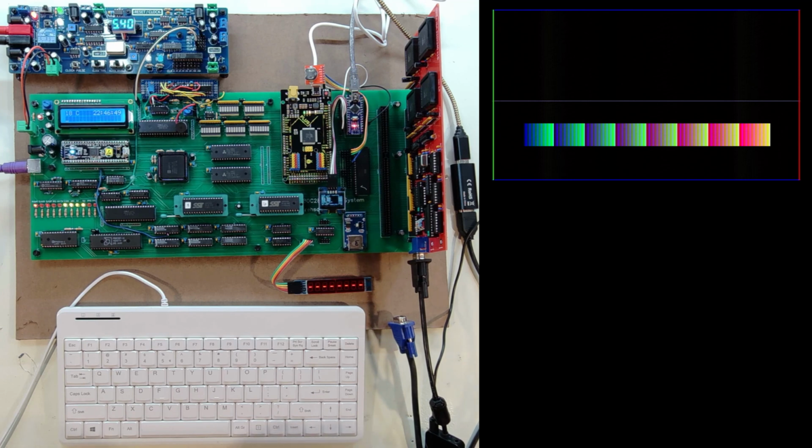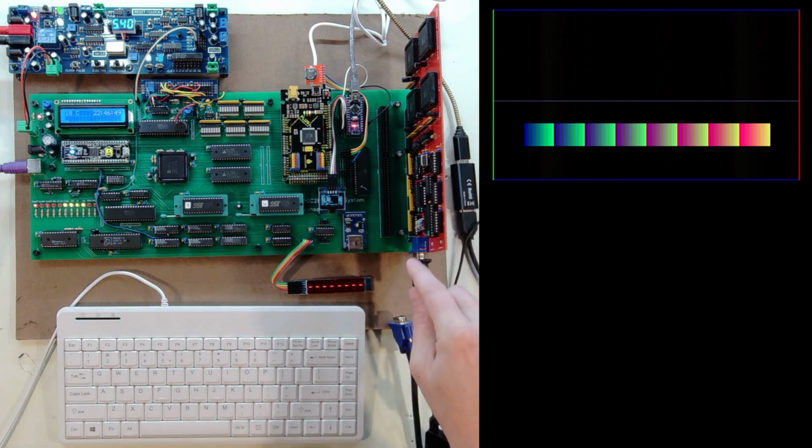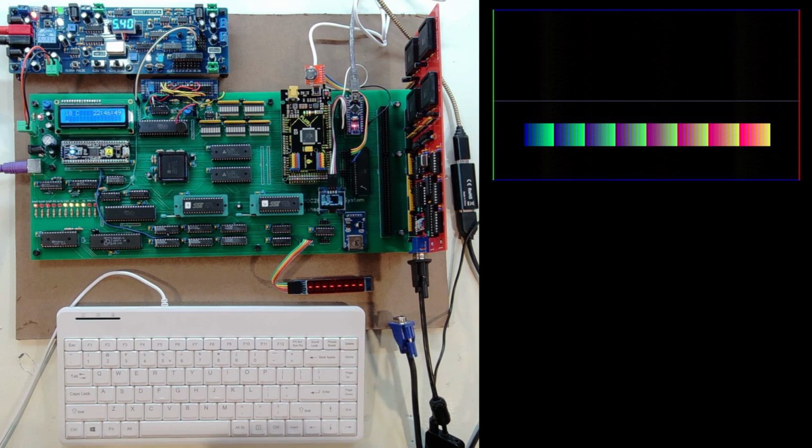But that's a quick test pattern, and I can use that to look at it and say, do I see enough of a difference in some of the blues, for example? And if I don't like that, then I can come to the card, go to those resistors, and adjust the resistors a little bit. As long as it's close or good enough, I'm not going to get too worried about it. It's probably good enough where it's at. I'm not real concerned. It's in the right ballpark for coloring, at least. Maybe in a future card, I could even put 8 little pots there, so I could really dial it in and not have to be messing with resistors, but good enough for now.